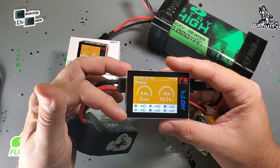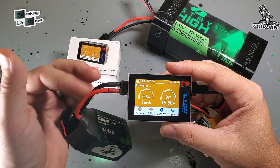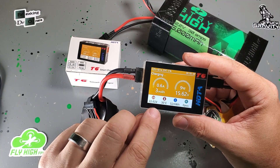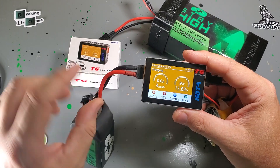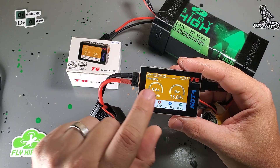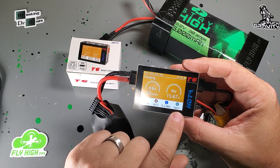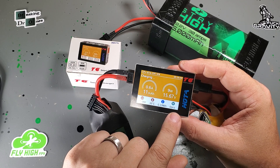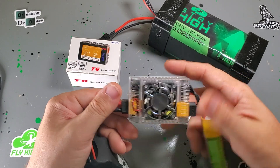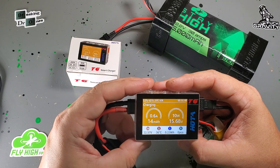If you click on here, it's going to give you a resistance test — it'll need to charge some to show a difference in order to give you the details. On the next screen it gives you a little more information: this is the voltage of the source battery. Also, if you were going to charge from a battery, you'd set your input voltage — for the Stay High, you can go all the way down to 16 volts. This is the temperature of the unit itself, it has a probe inside, how many watt-hours have been delivered, and over here is the total pieces — the total times you've charged a battery. Some of my bigger HOTAs are around 2,000 charges. The fan has not kicked on yet since it's such a small battery; the fan will kick on automatically based on load as the temperature creeps up.